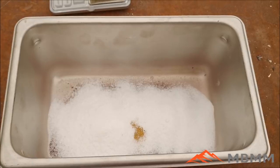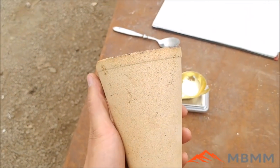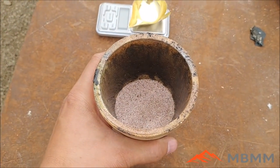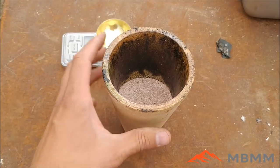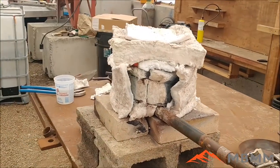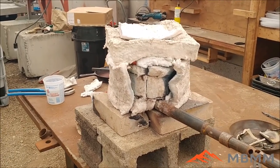I'm going to take our half a gram of gold, dump it in, mix it all up, and put it in a crucible. This is a 60-gram crucible from Legend Mine Supply — you can find them online, these are super cheap, less than two dollars a piece. I'm going to put it in our furnace, smelt this stuff down, pour it in a cone mold, and see if we can get a button out of it.